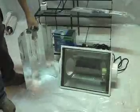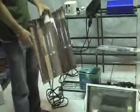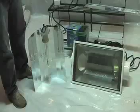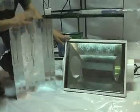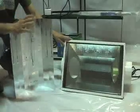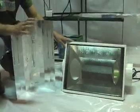This is the inexpensive batwing. The nice thing about the batwing is that it's inexpensive. The not so great thing about the batwing is its reflective index is around 86%. When we're looking at having a grow light we're going to have for a long time, if you're using a batwing, and that reflective index is 86%, that tells us that you're losing 14% of your light before the light even comes out of the reflector.